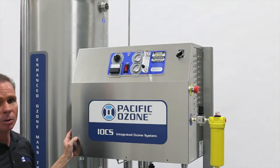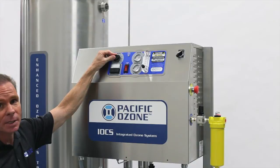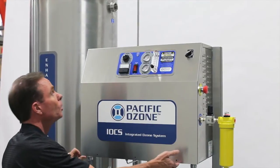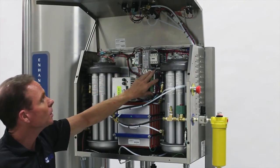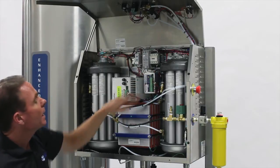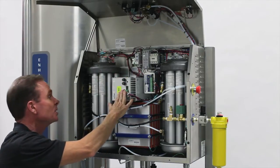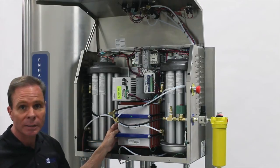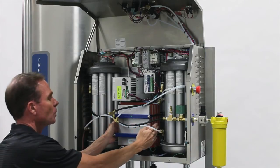Just to show how easy it is to control this on the electrical side of things, we start first of all with a manual control knob. If we want 100% ozone, we'll turn the knob to 100%. If we want 50%, we'll turn it to half. From here, the control knob signal is then delivered to the high voltage power supply controller. It's here where we take the mains electrical voltage, whether it be 115 or 230 volts, and then regulate it to the high voltage power supply. The high voltage power supply then takes that varying AC voltage and sends a high voltage varying AC to the reactor cell.